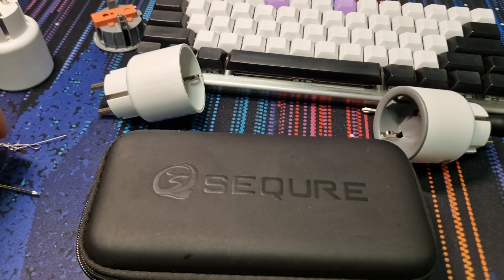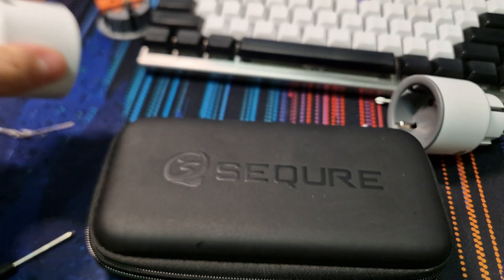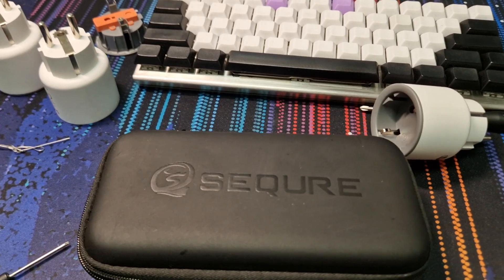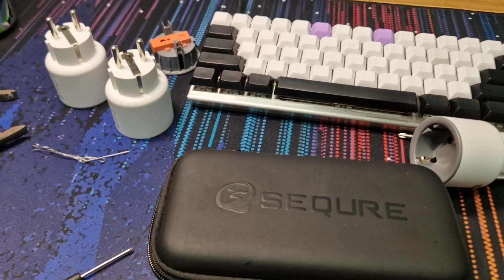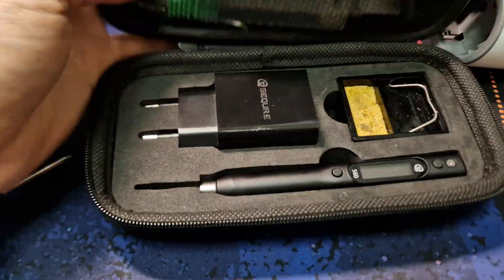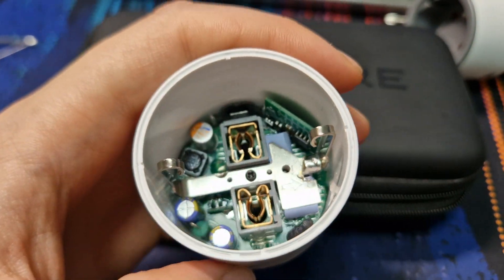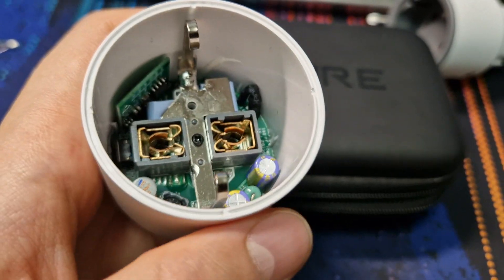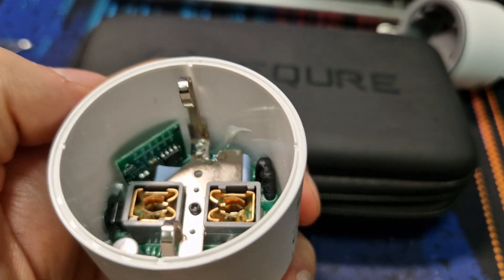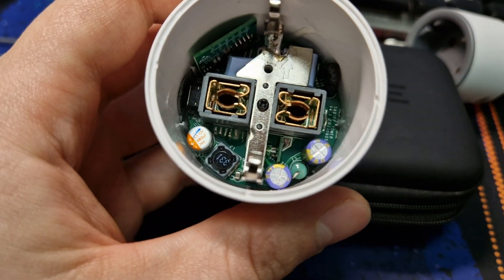It'll heat up to 450 very slowly and the moment you touch it to the solder joint — these solder joints are chunky and beefy enough that they will just wick away all the heat. So a soldering iron capable of delivering 20–30 watts to the joint is needed. It might be a 60-watt iron but it also has to be able to get that heat out through the tip and into the joint. That's why I'd recommend something with integrated tip cartridge heater styles. There's also some glue around the sides — it's fairly soft glue and I just picked it away with tweezers.